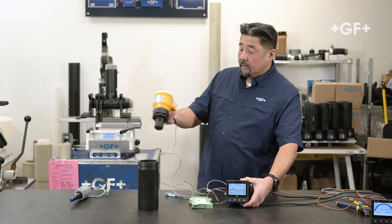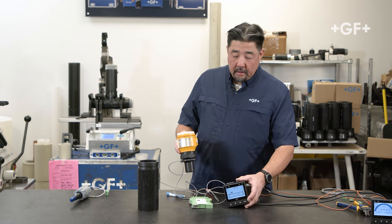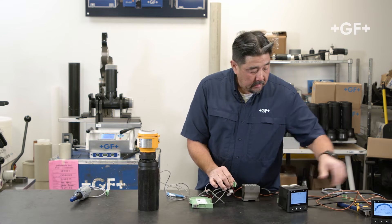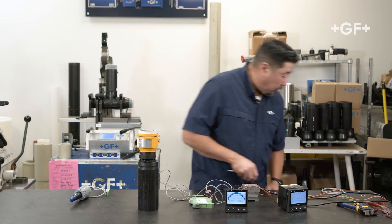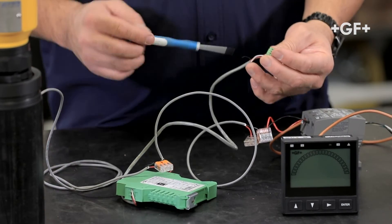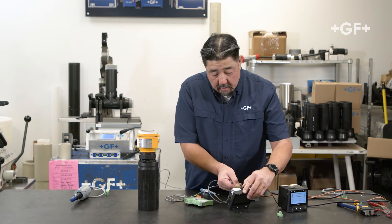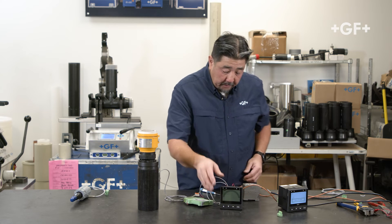So that's how we wire a 4 to 20 milliamp device into the 9950. If we were to work with the 9900, all we would do is use a 9900 S3L connector. Let's take power off and put on a 9900 S3L connector. Just like the other one, black is V+, red is data, and white is ground. Snap that into your 9900 and let's bring power back up.